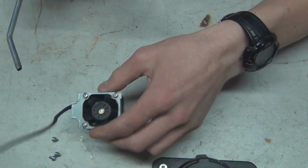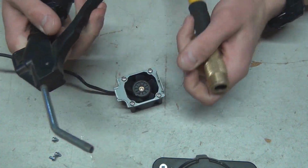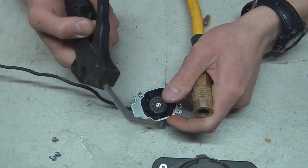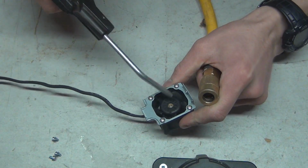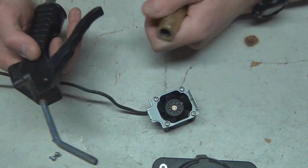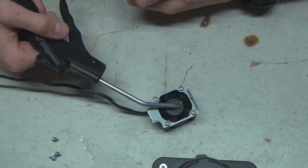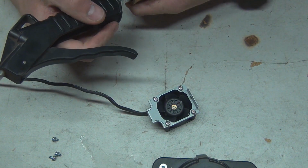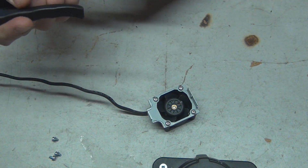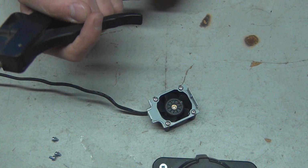One thing to note, you want to be pretty careful when you're blowing out these fans, especially with highly compressed air like this, like 130 pounds, because you can really easily overspin these fans. Wear safety glasses like I am, because you can lose an eye when these explode from the centrifugal force, so just keep an eye out for that. But I'll quickly spin this thing up here and you'll see that the bearing still sounds like it's bad.